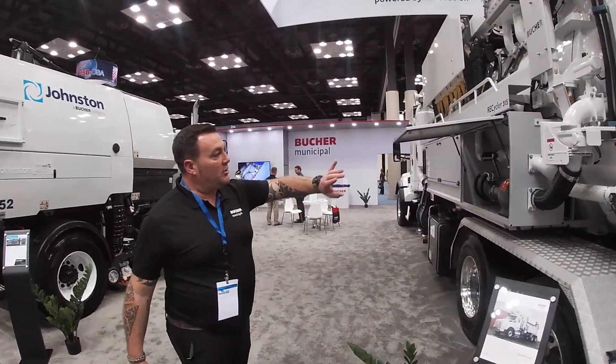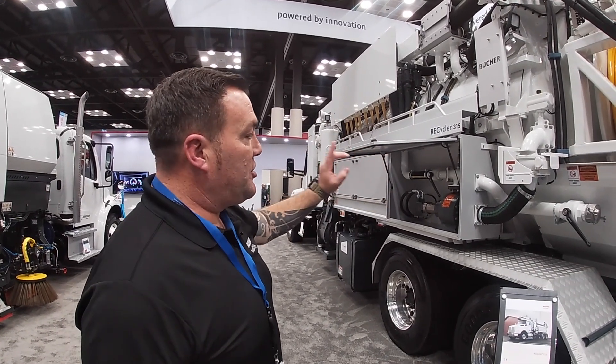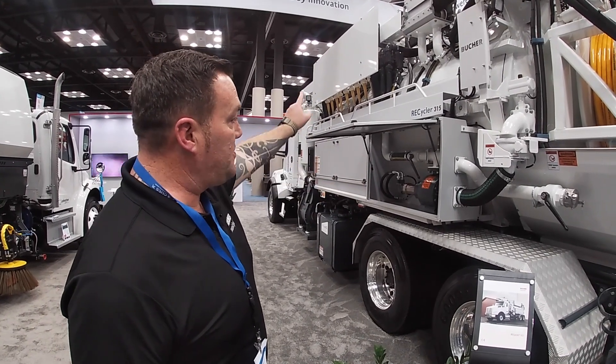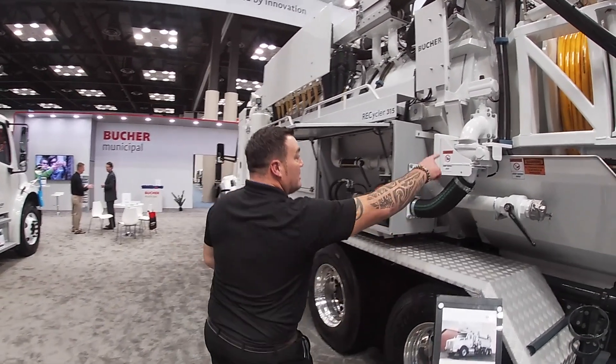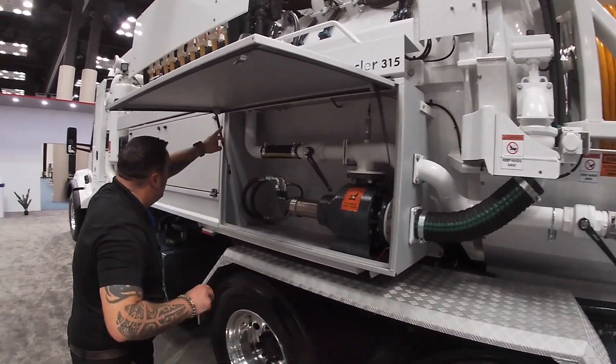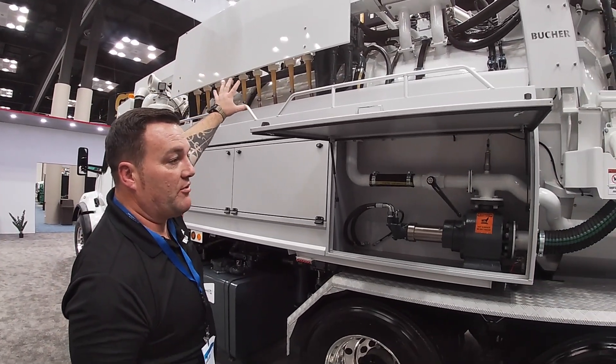But like I said, instead of sending the water forward to keep the front tank level so we have continuous jetting, we're going to shut the handles off so the bypass happens, and the water instead of going this way, comes this way. We come down from here, and the usual procedure is: up, along, through, into the cyclones — clean, separated, into the front tank.